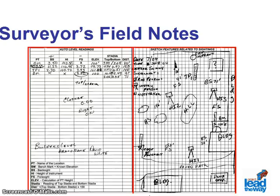The collected stadia and crosshair information are placed on the left-hand side of the field notes, while on the right-hand side we record sketches, descriptions, compass direction, date, time, weather, and names of workers. Any buildings, fire hydrants, or other objects are placed on the sketch so that the surveyor will have a better understanding of the site when he or she is back in the office.